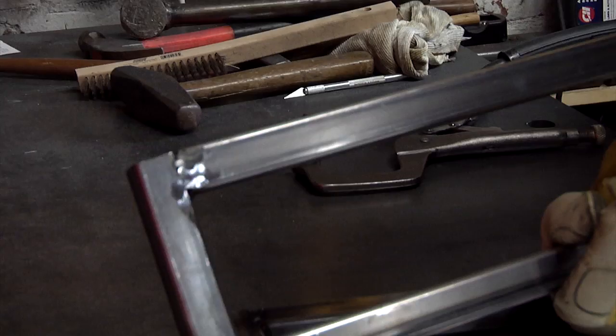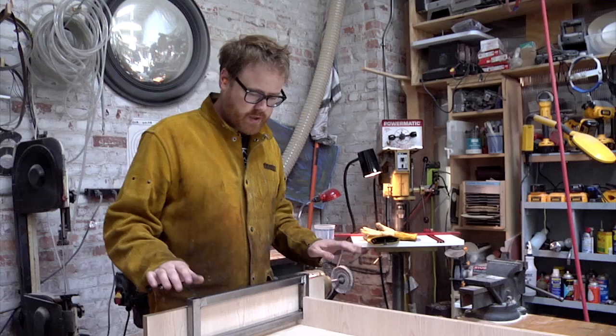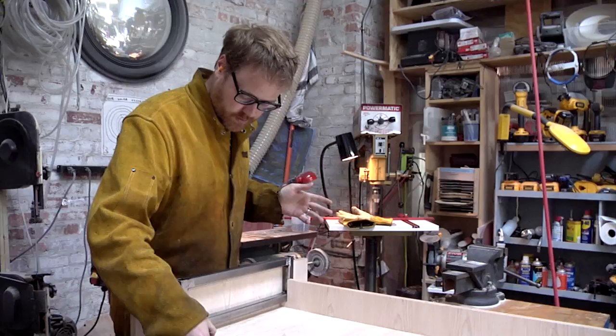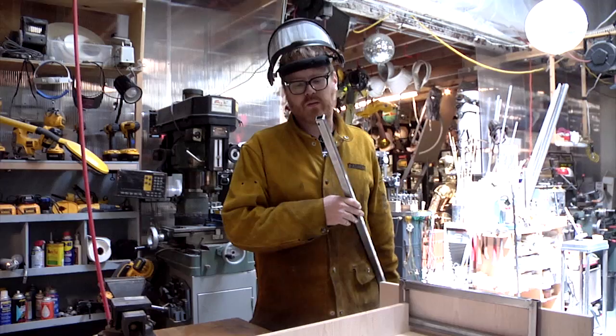When I actually grind down these beads a little bit, I had good penetration on more of them than I thought. I may not even touch them up. This one up here could probably use a little bit of help and maybe this one, but they're okay. Here's the desktop. Here's the two boxes I've made — these are the horizontal spar pieces. What I have to do is figure out how much I need to grind off so that they'll be the right distance. Right now it looks like about an eighth of an inch on each one, not very far. So it should be fairly straightforward and just take me a minute or two on the bench grinder.